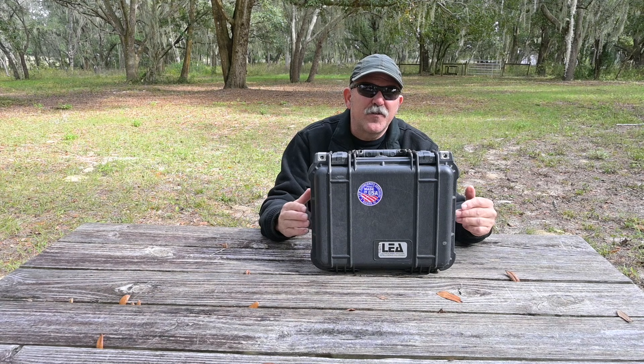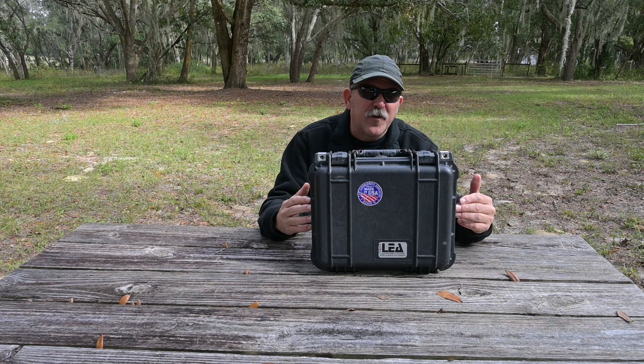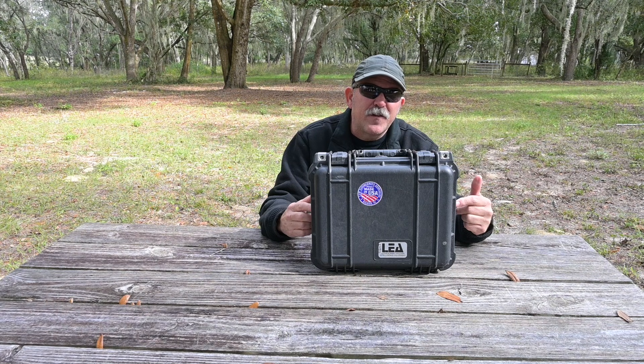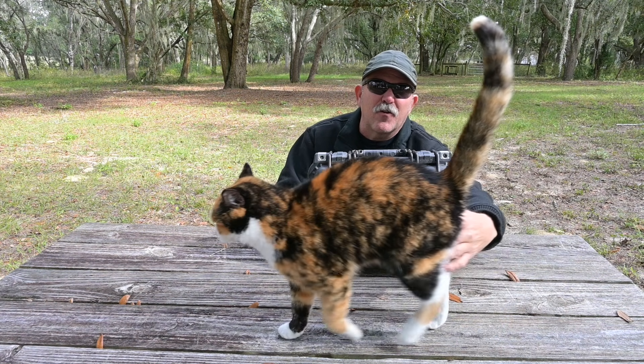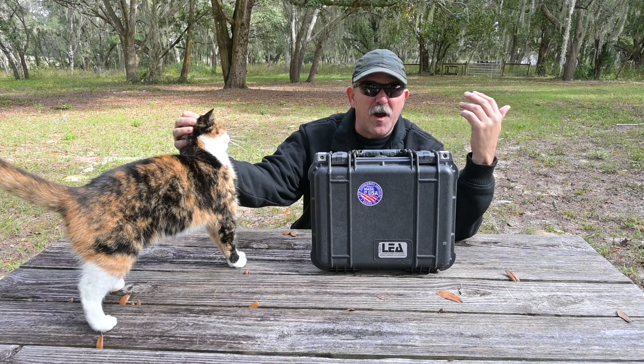This device is a crystal-tuned, internally duplexed, self-powered VHF high-band FM radio repeater. While it can be used for voice land mobile radio traffic, that isn't its intended primary application. Its intended use was to extend the range of legacy VHF FM wireless microphones for surveillance purposes. One of these placed in an advantageous location gave users the ability to distance themselves from the target to accomplish their task.